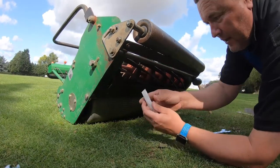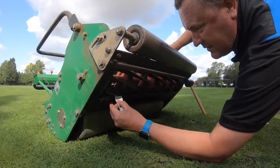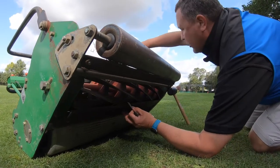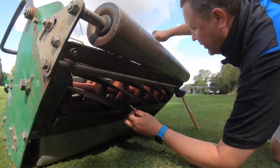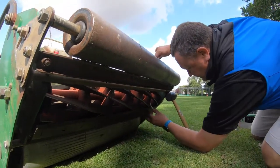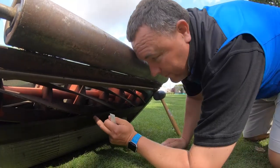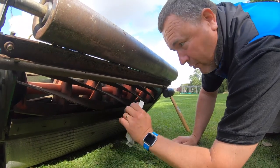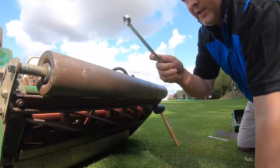Okay, if you wanted to see if it's maybe too tight, you could do a single piece, and it cuts a single piece as well. So if I see a single piece, I may try a single piece all over, and then we just see it just folds that bit. But if I was to go to a double, it cuts one, folds one. Okay, cuts that side. So it's probably coming towards the end of the season, it's looking like it may need a regrind. It's cutting in the middle, but not as well as the edges, which you tend to find on these